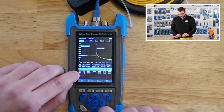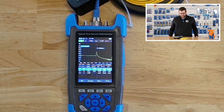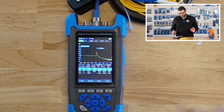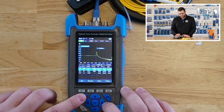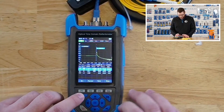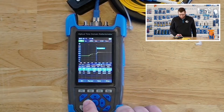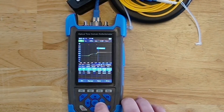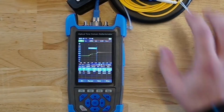As you can see, there are two events that have occurred. One is a reflective event, and one is an end event. The reflective event is just showing the connection between the launch cable and the fiber cable that we're testing. The end event just shows that this is the end of the fiber optic cable. If you want to get a closer look, you can change to the cursor and zoom in on this event. Here you can see in greater detail — the reflective event at the connector is at 1.01 kilometers, and the end event occurs at 1.02 kilometers, which makes sense because this is a 10-meter-long cable and this is a 1-kilometer launch cable.